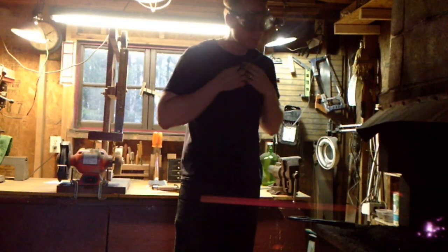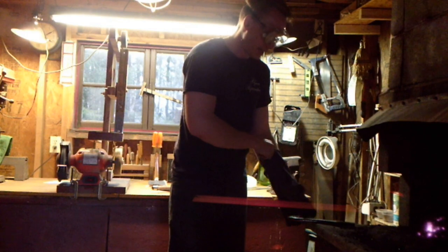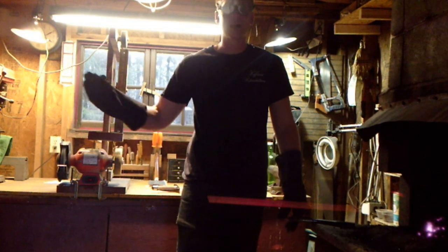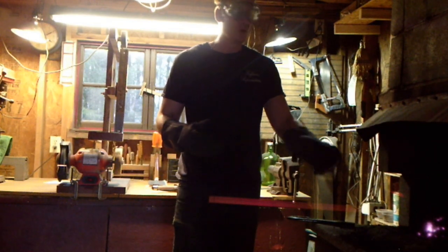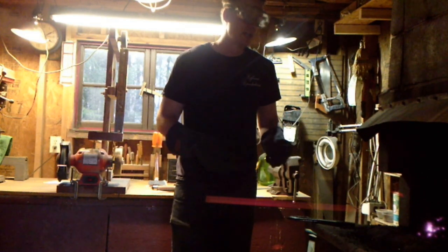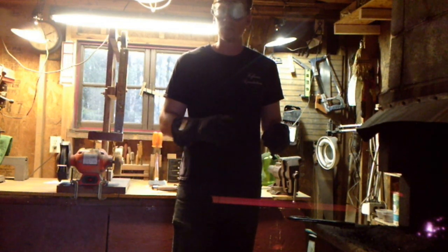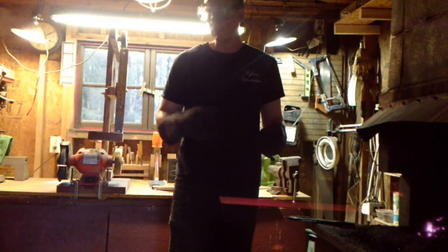So we'll get on the safety equipment here. Don't be afraid to pull your steel in and out of the fire to check the temperature. It's kind of an old wives' tale that the sage old blacksmith always knew when to pull the metal out. Even though I've forged hundreds of blades, I still pull the steel out when I think it's getting close and check. Don't be afraid to do that, because if you burn high carbon tool steel you will ruin it. You want a nice bright orange color — not too high a temperature, and not into the reds, because forging at too low a temperature will put stress fractures and cracks in your blade.